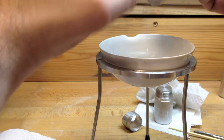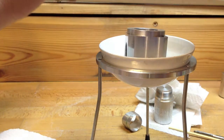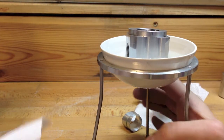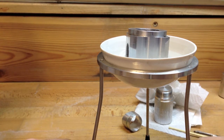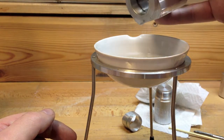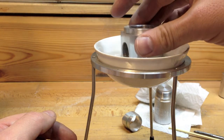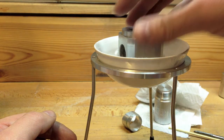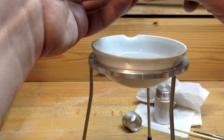I'd like to get rid of all this glue without actually affecting the metal, if possible. I remember on one of my very early projects trying to clean some superglue off a piece of silver steel, and I let it steep in acetone overnight. The next morning I came back and the whole thing was covered in rust. Little did I know the effect the acetone would have. So, that's all for tonight.